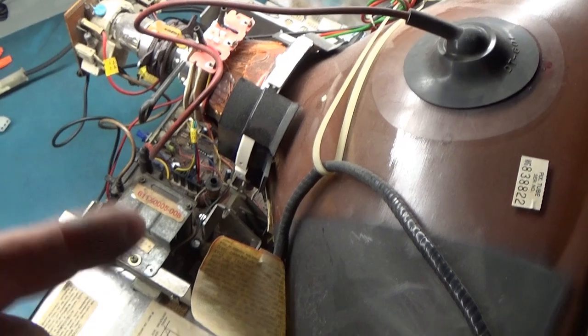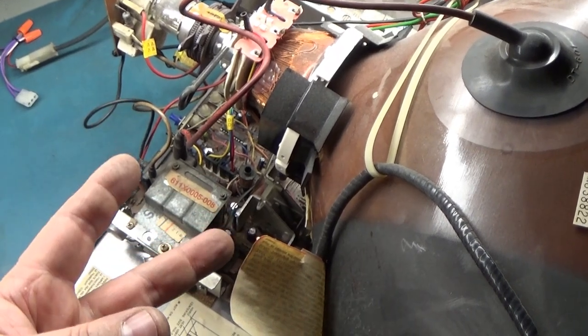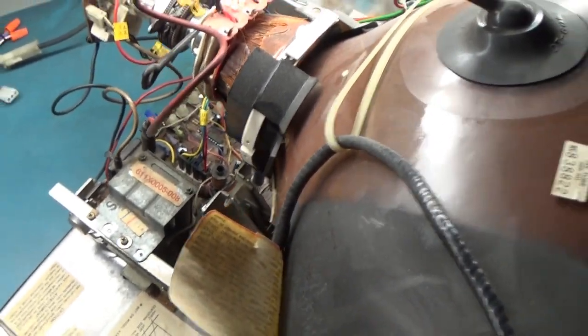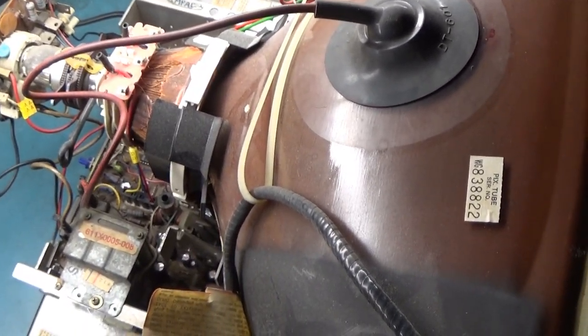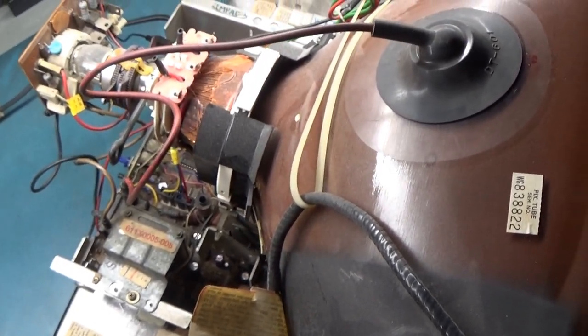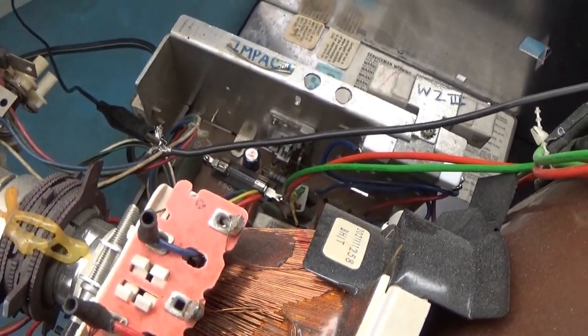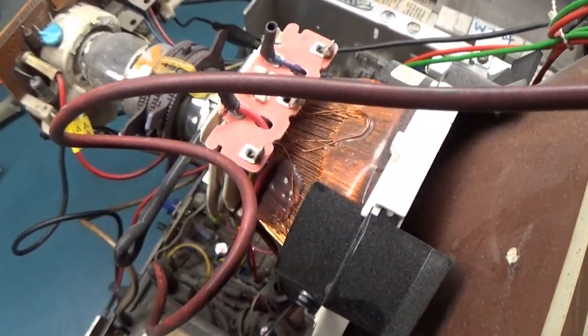Okay, tube acquired. We got anode, neck, yoke, ground, power. We don't need video. I'm just checking to see if it comes on. We don't need remote because all the pots are on the board. So we are hooked up, ready to go. I keep my hand here on the trigger just in case something goes haywire. We can flip it right back off. And we're hoping for some high voltage here. So let's see. 1, 2, 3. Actually, let me keep an eye on the fuse here. 1, 2, 3. Nope. Isolation transformer started humming like crazy, and I heard a little click. Fuse did not blow.